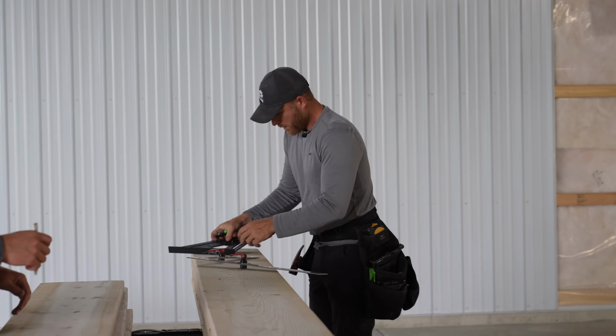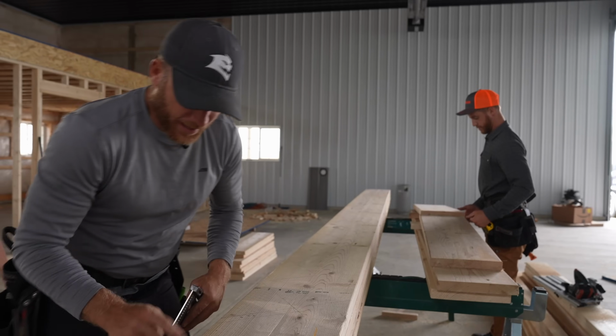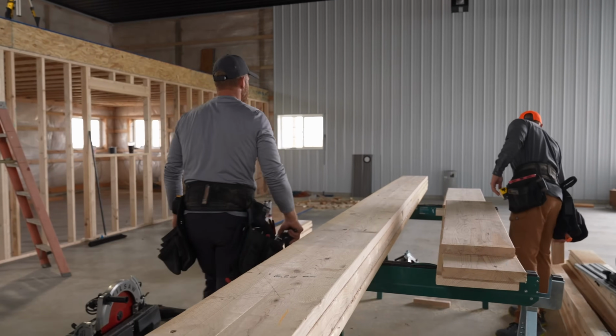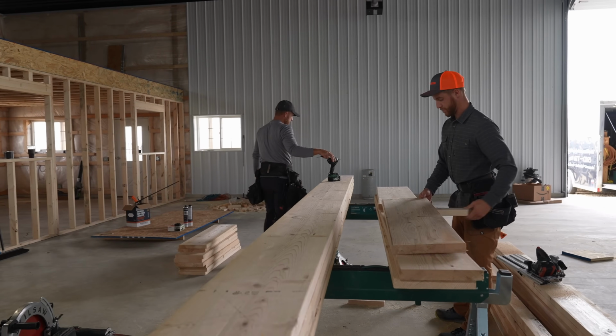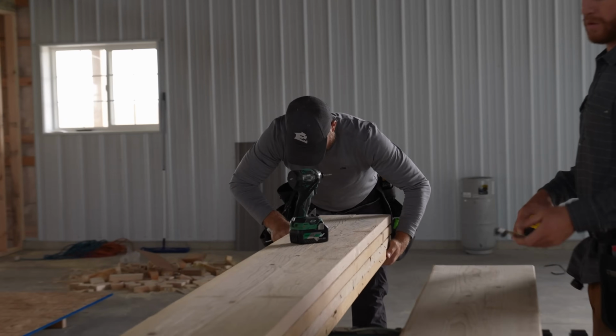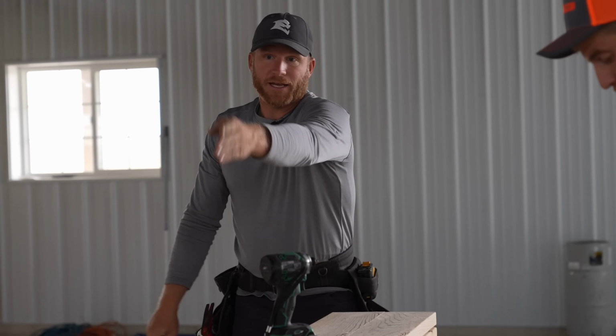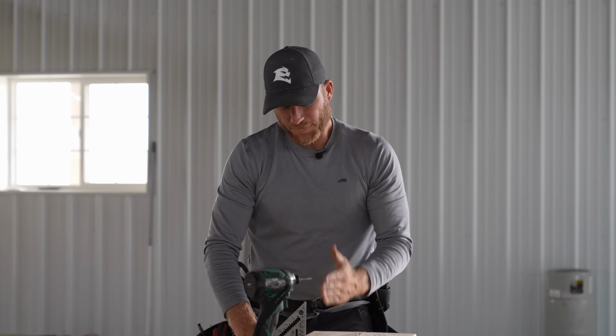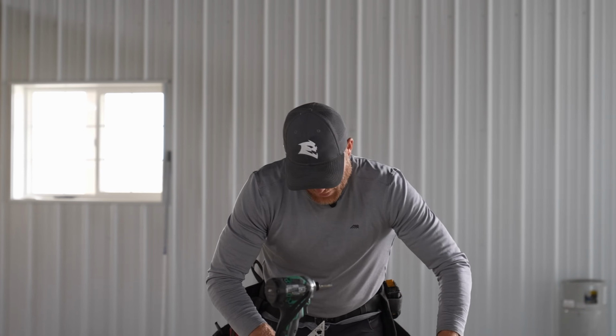which means this right here is our landing. Perfect. I got one screw here holding the face of all four of these because I'm gonna gang cut these, and then I need to come all the way down to the bottom. And I need to make sure that my bottom is also nice and flush, because most likely whatever happens in the middle, it'll all get cut the exact same. So in essence, if there's any major crowns or irregularities in this lumber, as long as the first tread and the last tread are straightened out, it should all come out nice in the end.